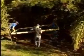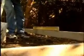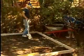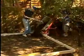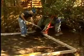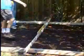Once you have dug the area out and made it as level as you can, place the box in the area. The required thickness for your slab is 100mm. Using a spirit level, fill or dig out areas in order to ensure the box is level. In this area there is a slight slope in the land running into a far corner. This makes the area around 180mm too low, so we need to bring it up 80mm and fill, remembering that our slab thickness is 100mm.